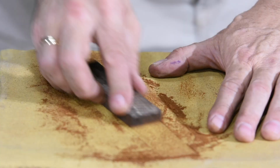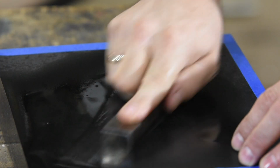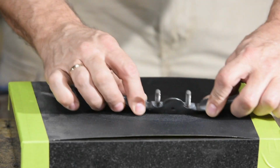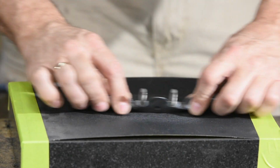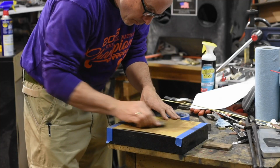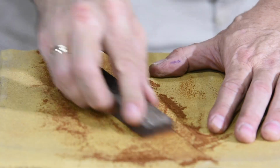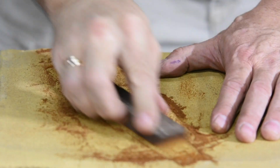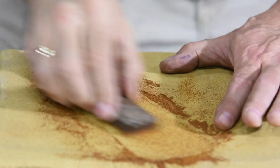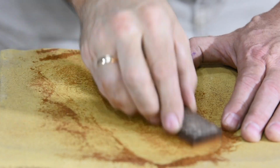You can do this with wooden handle scales, steel, bolster material like brass or stainless steel. It all works. The one thing that I'd recommend is that you don't just sand in one direction. Some people like the figure 8, or you can turn it around as you go. Also, move your fingers to different locations. Especially with thinner or softer materials like handle scales, just the pressure of your fingers can cause it to dish out in those locations. If you don't take these kinds of measures, you'll tend to sand unevenly.